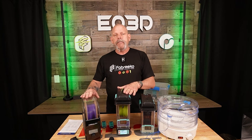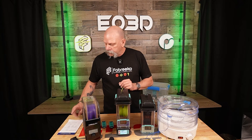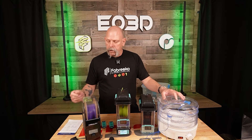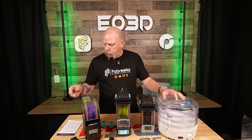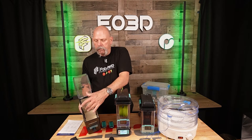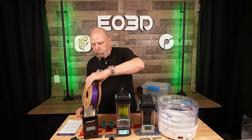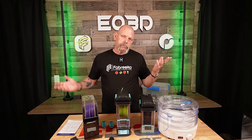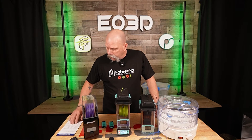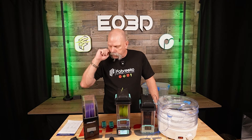On these two here I did averages — I would run them for 30 minutes, then take an average over a 10-minute span. The Creality: I only set it at 60 degrees — it actually maxes out at 65. I set it at 60, ran it 30 minutes, took a 10-minute average. At the bottom was 67.8, up at the top was 55.1. Something to note on this one: it's got a metal bottom in there, and that metal bottom got hot — like burning skin hot.